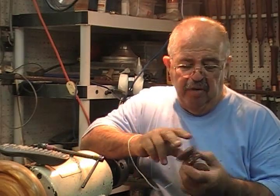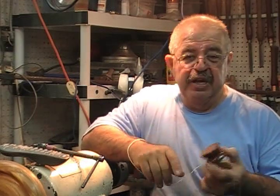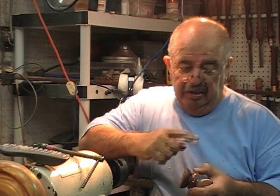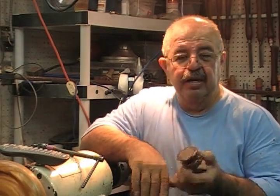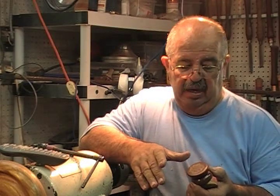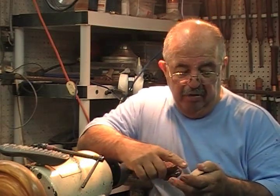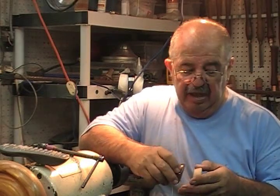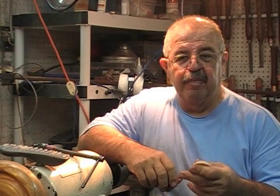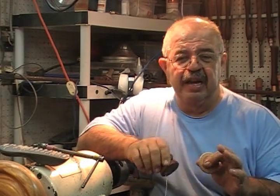Two 1/8 inch drill bits. Two pieces of drill rod. A piece of 1/8 inch rod bent in a U that I can lay in like a fork. All right? Those all work. Then if it fits, pull it back apart, put a drop of glue on the end of it, no excess, push it back together, get your rod in there, and clamp it for just a minute. Clamp it, why? Because you don't want it to move. You want it to be spinning even.